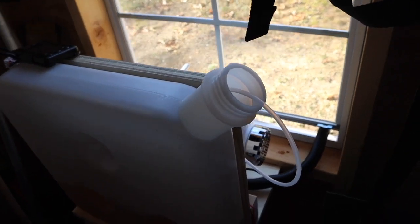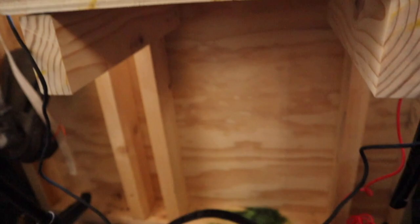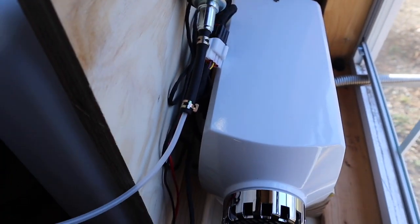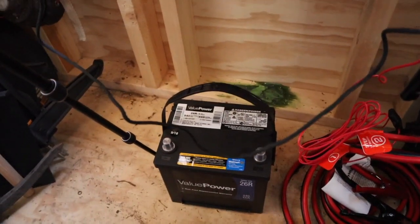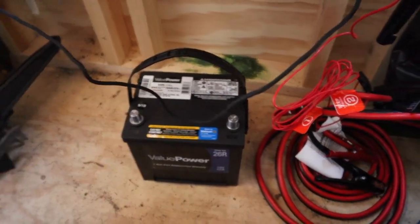We are currently in my shed. I just placed two two-by-fours mounted to the studs next to this window. I have the fresh air intake and the exhaust piping out on this side. That's where the fuel pump diesel air heater controller is hooked up. I filled it with some fresh diesel and this will be the battery I am using to power it up. I've never started this up yet, so let's just see how that goes.